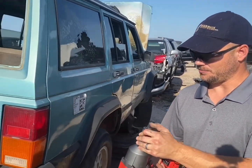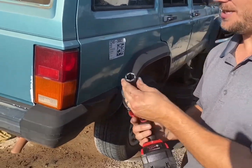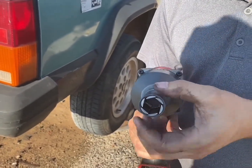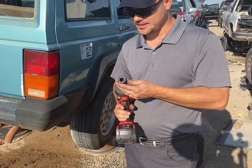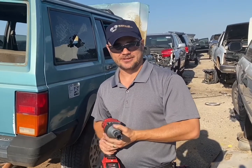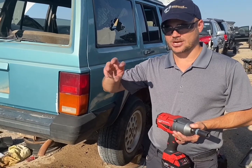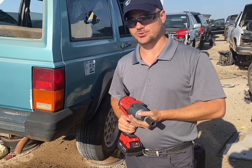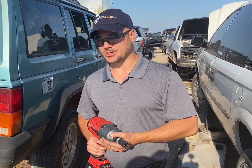What called me to pause at this moment and talk is that it's becoming more evident that the beauty of this design is that all of the force is distributed evenly, and it's on the flats. There's so much dependability here because there's no spike effect. With a traditional static socket, every time it hits that corner, it's like taking a chisel and hitting it with a hammer. And over time, some of these newer sockets are not made as good a quality as they used to be.